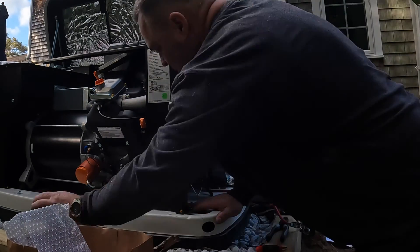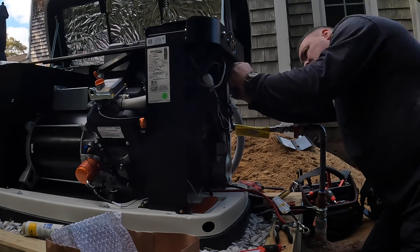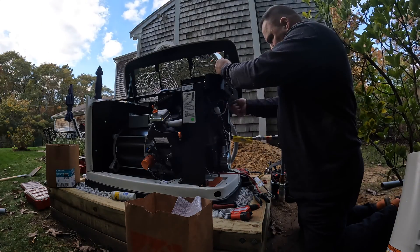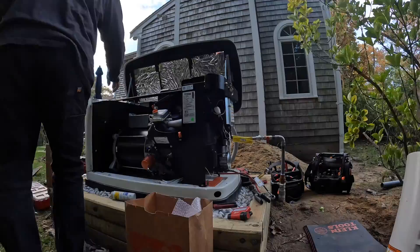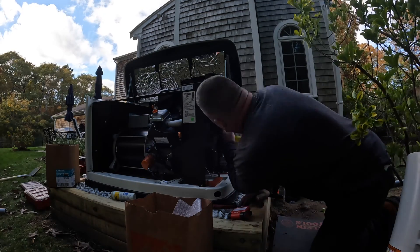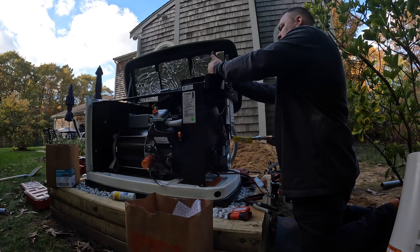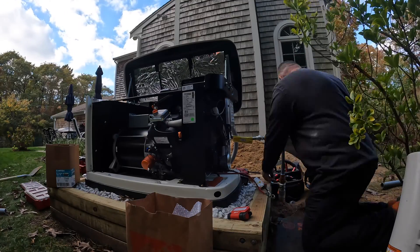I no longer do maintenance but I do offer installing and wiring generators. At this particular job, the plumber did not contact the utility gas company to upgrade the meter so the generator had sufficient gas — I believe it's between five and seven inches on the water column. They ran an inch-and-a-quarter line from the gas main but that portion wasn't done. Even though I spent two days wiring this generator up, I was not able to start it because it's not yet connected to gas. I will be commissioning it remotely with Sal. As a Generac dealer I do get certain perks, including unlimited assistance for commissioning at startup. If you like this video hit the like button and don't forget to watch Part 2.